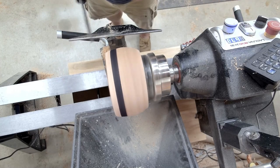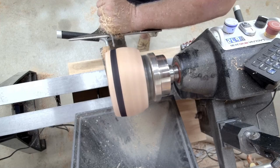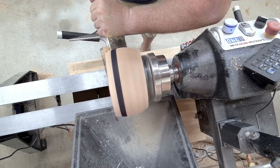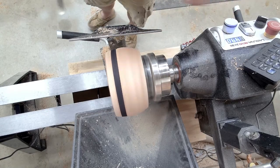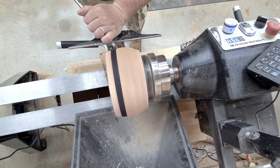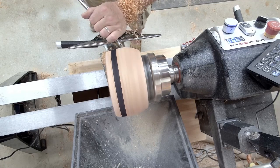I'm using a parting tool just to take the edge off the texture area and create that eighth-of-an-inch indent in the bowl as it is now. Then I come in with the half-inch bowl gouge with the thumbnail cut to remove the material up to the depth of the parting tool cut. You've got to be really careful so that the bowl gouge doesn't catch and run across the face, because you'll have to start all over again. But with light cuts you get the job done, and the tear-out does eventually get removed.